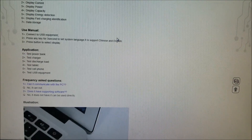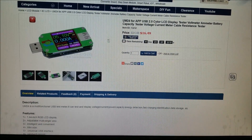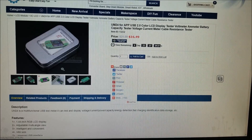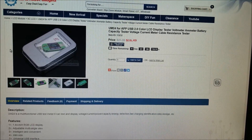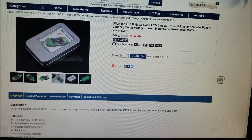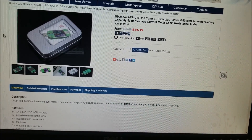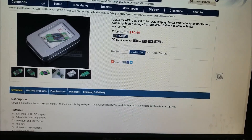If you're able to reflash the firmware you could feasibly enable it. It's definitely useful — a good handy multi-tool sort of thing to keep in your bag. One thing to note: I did try this with my Galaxy S8 Plus, which uses Qualcomm Quick Charge, and it does not do quick charge as I expected. It limits the current to about an amp to an amp and a half — so it will handle higher-speed charging devices but it will not increase the voltage to 9 volts and pump two or three amps. Not that I really expected that from a device this small.